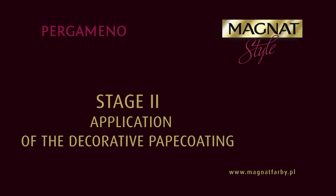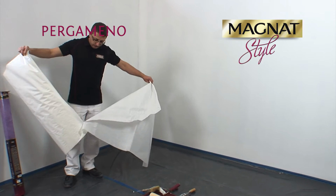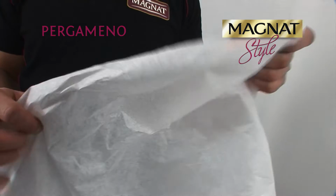Application of the decorative paper coating. Before applying the pergameno decorative paper, it is important to prepare the required number of single sheets. Tear away those edges of the decorative paper sheets that will be joined across the same plane. Next, crumple the sheets by hand.